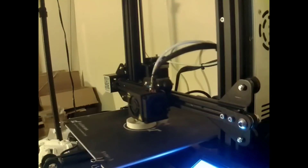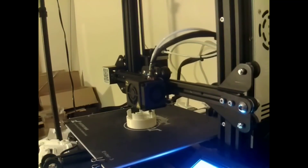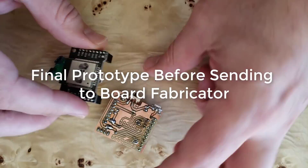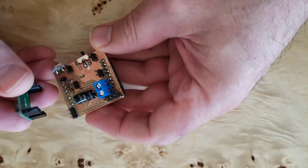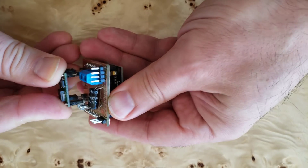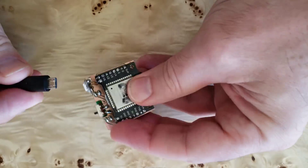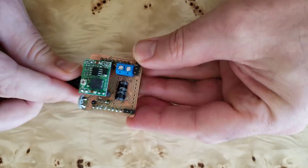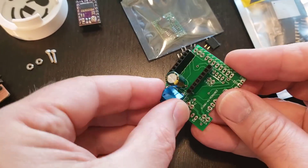I printed out the new wrist cap design in the meantime. I soldered it up — mostly for fit, but I got most of the components working too. During this phase I realized I had the DC-to-DC converter reversed, so thank God I prototyped it before shipping off the final board to JLCPCB, because that takes a couple of weeks.